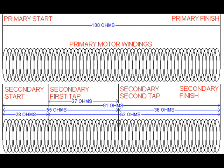I went ahead and put the readings in that I got off one of the other ceiling fans on the ohms. Turn your meter to ohms — that's the omega symbol. Start touching wires and getting your readings. Don't hold it with two hands; you need to clip one of the wires or it's going to be measuring the ohms between your hands and the rest of your body. Set it on about the 200-ohm scale.